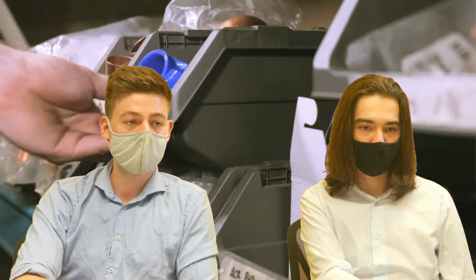We got a question from Chris about how the V rollers hold up during continuous production, and we've used Ender 3s, the same Ender 3s, for about 2 years, and the V rollers are fine. We only replaced them on printers where they were incorrectly set up in the first place. Sometimes you just crank a little too hard on the eccentric nut and it creates a flat spot on the wheel. It happens to the best of us.